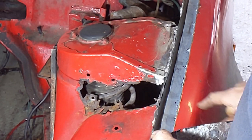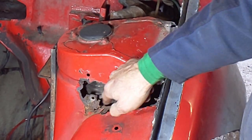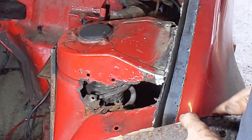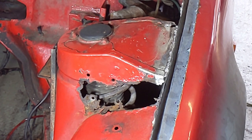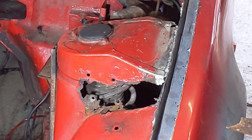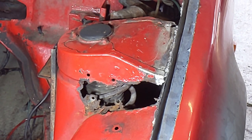I'm trying to decide if I can afford to cut all of this out, because the car is sat on us at the moment and its springs are under pressure, and am I going to weaken it too much or bend it by cutting that out? So maybe I should get a jack stand under that wheel just to take some pressure off. I think that's probably sensible.